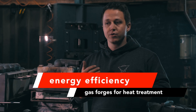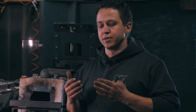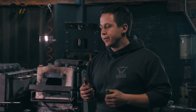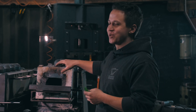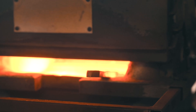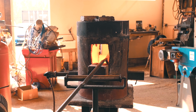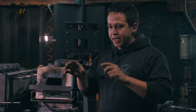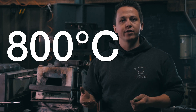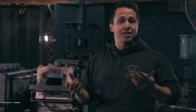Next up: efficiency. When you use a gas forge for heat treating, the efficiency is very low. Basically, you put in the propane or butane, mix it with air, it combusts, and we transfer that into heat. That heat moves around in the gas forge, heating up the knife, but it also heats up the walls. The gas stream still exits at 600, 700, 800 degrees and basically heats the room. So all the energy coming out of the off-gas is basically lost for forging.